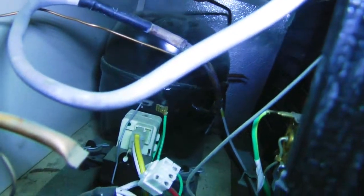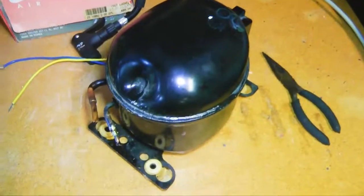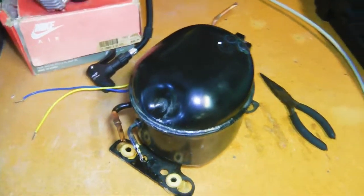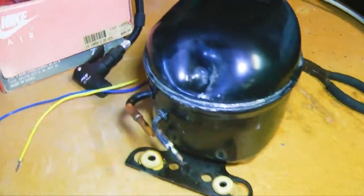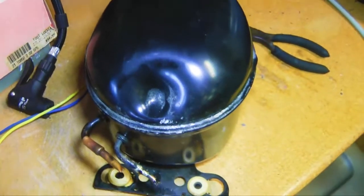Just like this one right here — as you can see, there's one inside there slightly bigger, but it is inside this little fridge right here. The cool thing about these is they can be a vacuum pump and a compressor, or basically just a transfer pump, and that's very, very useful. Here is the vacuum right here, and this is the output. We're basically going to just put an air chuck on the output and connect wires up, and it should work as a regular compressor.